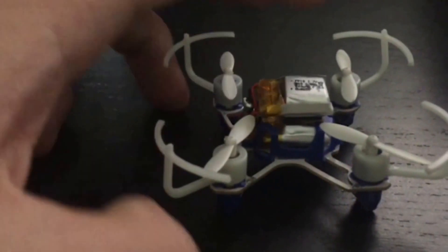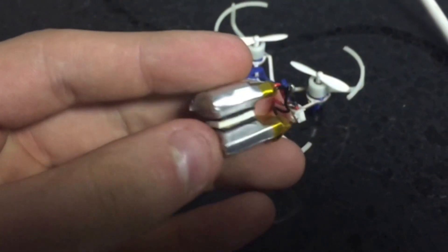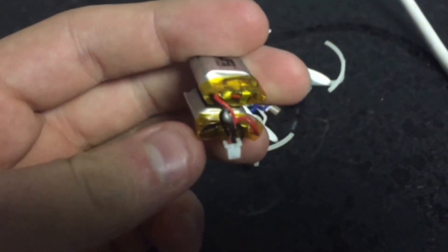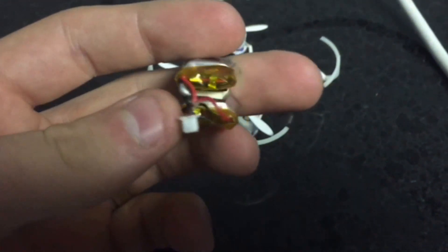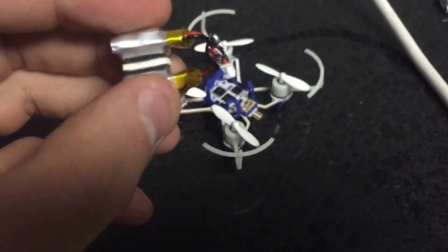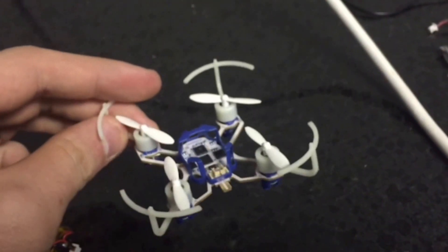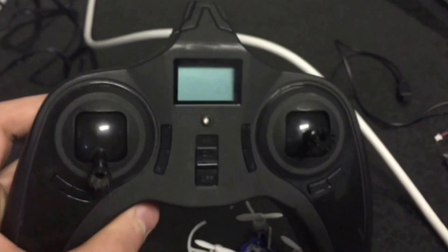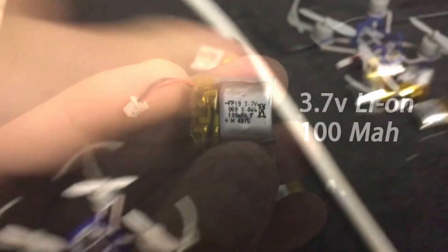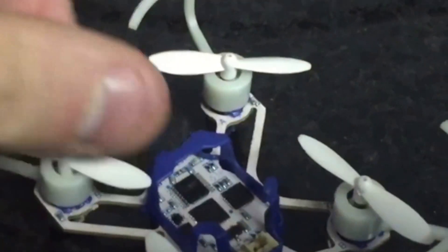At the end there's some video of the quadcopter with the two batteries flying. Just a quick preview — this is what it looks like. We see here I have the original battery in its casing on the bottom, and I was actually able to wire the second one in parallel. There's a piece of command strip in the middle that keeps them together, and this is how I soldered it up in parallel. The batteries I bought are 100mAh and 3.7 volt lithium-ion, and I got them relatively cheap on Amazon. I also added a prop guard that didn't come with the original quadcopter.